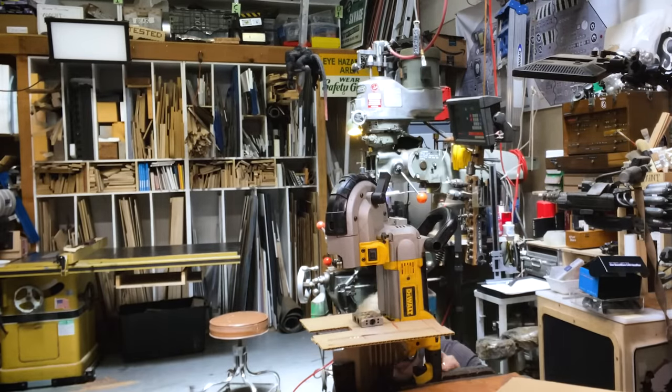First up, a 10.5-inch square of aluminum as my main table base, and then a 10.5-inch square of plywood. Not many people realize that you can quite easily cut aluminum on most table saws. The blade has carbide tips, and it generally does pretty great. It's loud. You'll want to wear hearing protection, but here we go.